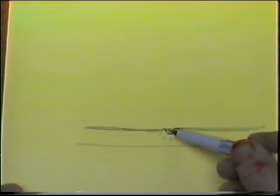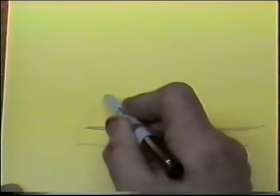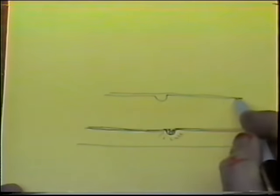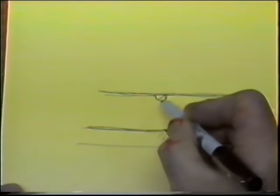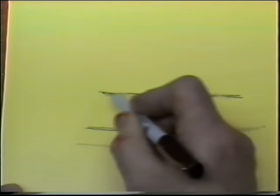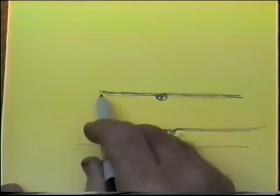So what you really want to do in that case is take a little more aeropoxy, mix it up, and just trowel right over this area with a paper thin layer. So in essence, you have a thin layer over the whole repair area that's attached to this. And then of course, when you go back and sand it, that should totally disappear.